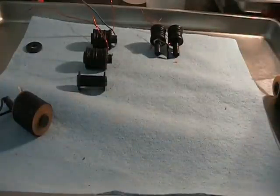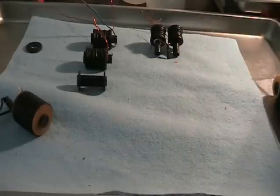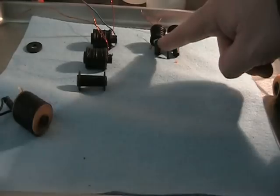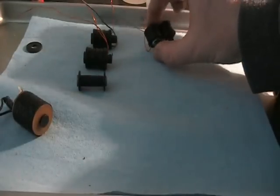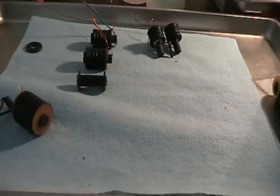Just use 24 gauge. The reason I don't use 26 gauge like a lot of Chinese machines is because if you ever take machines apart and put them back together, it's pretty common to snap the wire from underneath the base just from wiggling it back and forth a few times — it'll pop off and then it's ruined. So 26 gauge is way too thin. It also gives you too much resistance — the thinner the wire, the more layers you have to use.